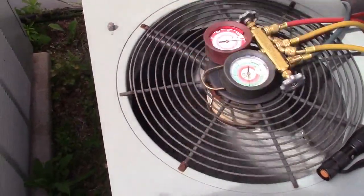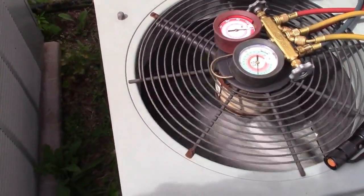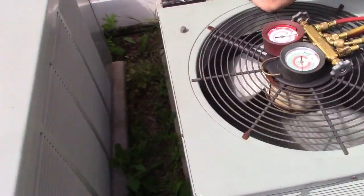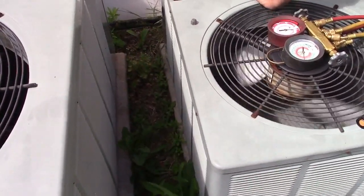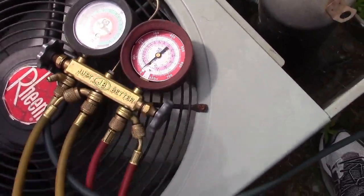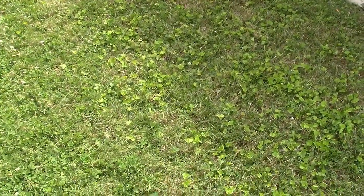You want this to blow up hot when it comes out here? Yeah, the pipe is going to be ice cold right now. Let me feel that, because I'll know based on what I saw the other day. It's hard — this is hard. You have a temp gun? I got a gun. You want to go shoot a vent? Absolutely. Just shoot the return and then shoot a vent — you should have close to a 20-degree split.